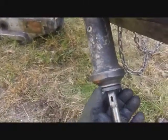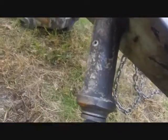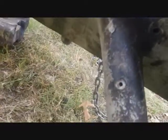This gear on the end here looks like it might be more trouble than it's worth too, because I think I've got to take this nut off, then the dial off, and this shaft must go through. That's probably what that opening is on the other side - it looks like a straight shot right across, so you'd drive it through there. Either that or there's a set screw buried in here. I've actually got a feeling that's a place to put oil - here's another oil one right there. You can see it's got a little gallery going down that little tube into that bearing support for the shaft I took out.